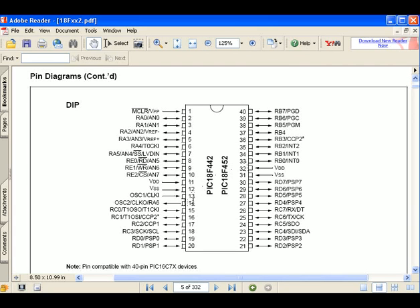Oscillator 1 and Oscillator 2 — these are the two pins that your external oscillator connects to. Pin 20, then pin 21 on the lower right going up to the negative power supply again, VSS, and pin 32 VDD. For programming, I generally haven't had an issue with just connecting these two. And here are your programming pins — PGD and PGC. This is what I'd use with my little adapter. PGD would be pin 40. From there, PICkit2 will be able to identify what PIC Micro is connected if you've got power and memory clear as well, and you can simply download your program onto the PIC.